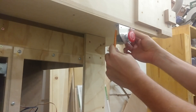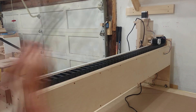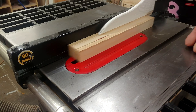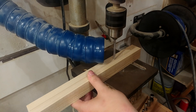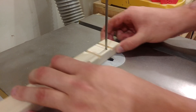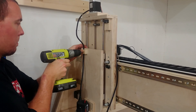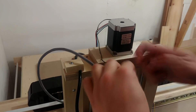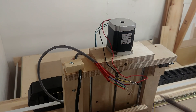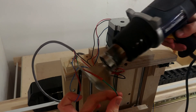I bent up and drilled a hole in a scrap piece of aluminum and mounted my e-stop push button. I then taped together all the cables that needed to go up to the gantry and started fishing them through the upper drag chain. I took a scrap piece of pine and drilled some holes through it — this gets ripped down to be used as clamps to hold all the cables in place. As I attach a clamp on the front of the Z-axis, I make sure to leave a little loop of wire for movement. The cables I ran to each servo are 8-conductor 22-gauge wire; I paralleled up my conductors to lessen the voltage drop. All connections are soldered and heat-shrunk together.